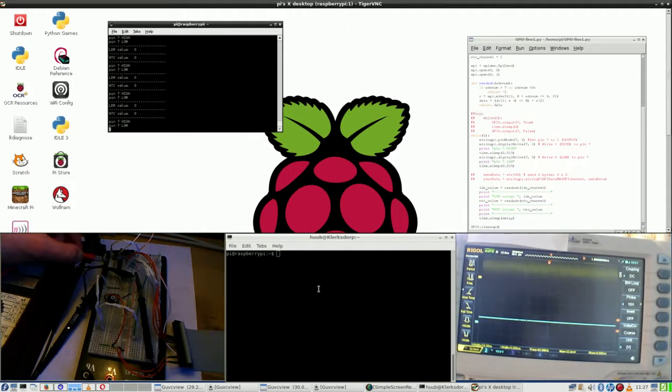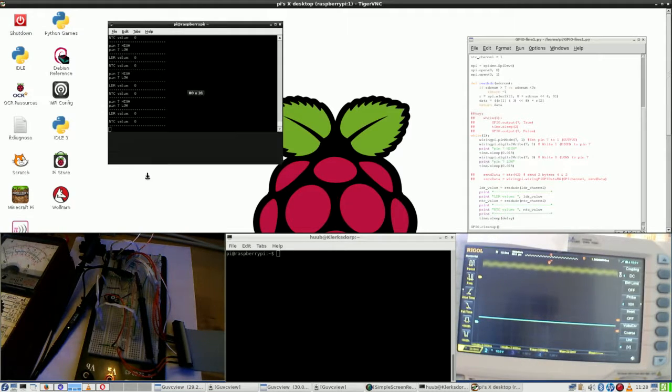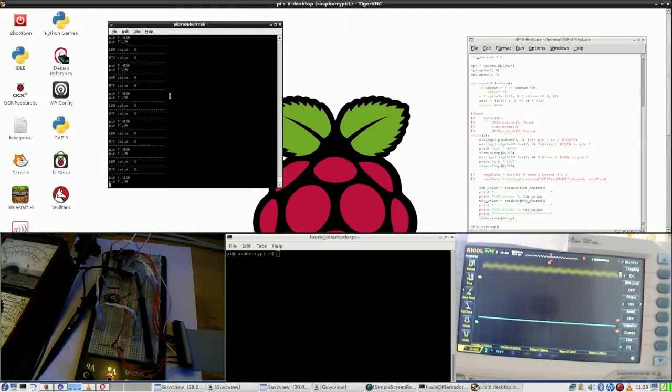And even when I touch it, you see the oscilloscope image go. So although with other experiments the NTC works out very nicely, here I don't see anything, and that the screen output doesn't show anything, yeah, that doesn't help either. So nice idea, but so far it has to be worked out. And like I said, I want to compare it with other analog sensors as well, but then I need a properly working ADC, which isn't doing anything right now. It did earlier, as you can remember, but not now.